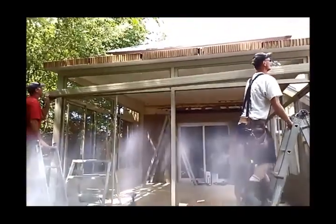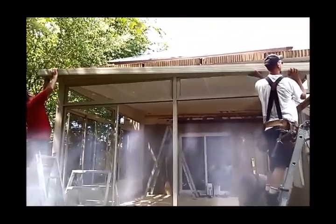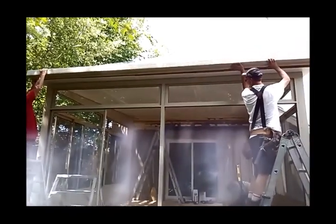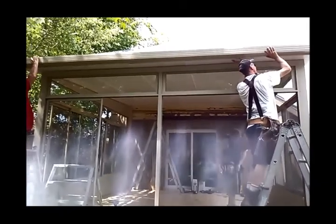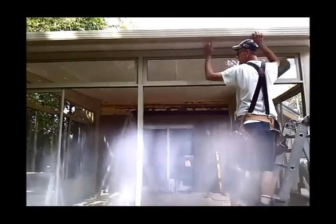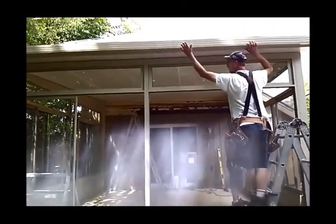The gutter fascia is going to be cut the same length as your panel hanger at the house. You just drop it on, it'll fit over the panels and over those cleats. And then the first thing to do is get some screws on the top, about every 16 inches to hang on to that sucker.